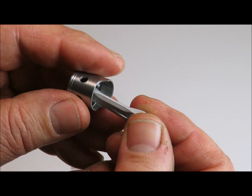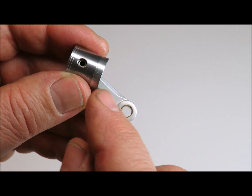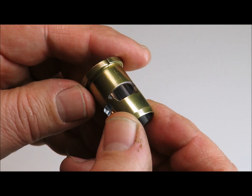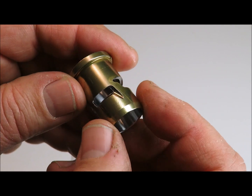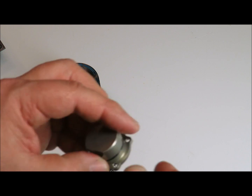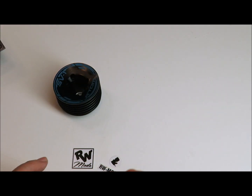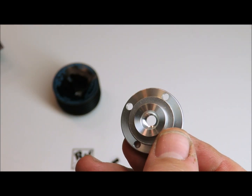The piston rod does have some bypass holes drilled in it. The rod looks like they copied the OS rod — I measured it previously and it's 30mm center to center. The sleeve is a really nice looking sleeve; the port shape looks about like the XZB ports — pretty nice. The back plate feels like hard anodized, which would be a nice wear surface. One thing I noticed when I took it apart was the head button — I did some measuring.